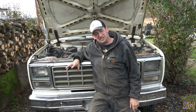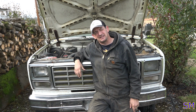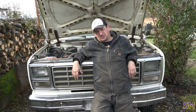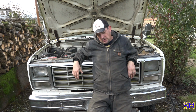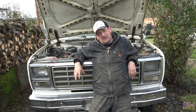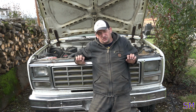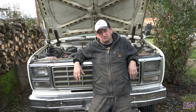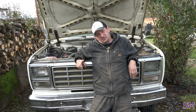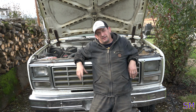So here's justification. My gauges work inside the dash, at least the temperature gauge now works. Oil pressure gauge did work. Now it's at 0, which explains why it's starting to knock again. Which means I legitimately have 0 oil pressure. So I pulled off the oil filter. There's no sludge in there. It looks like good oil. So it probably means my pickup tube is plugged, because you guys saw that sludge on that oil change when I got the old stuff out.